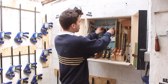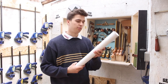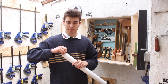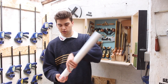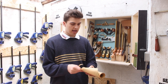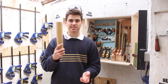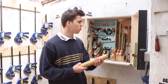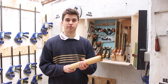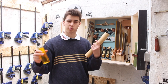Now, talking about leaving the workshop for a couple of weeks — you can also buy a special paper called corrosion inhibitor paper or rust prevention paper. This is pretty much the paper you get when you buy your tool, a sort of waxy coated paper, and if you wrap your tools in that it should stop them from rusting. This is something you would do if you leave the workshop for a very long time, like if you go travelling for a few months. It might also help to coat the tools in some oil before you put them in the paper — that would just protect them even more.